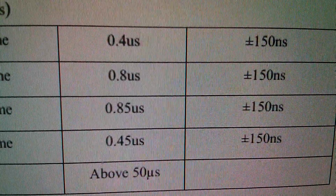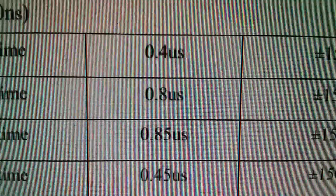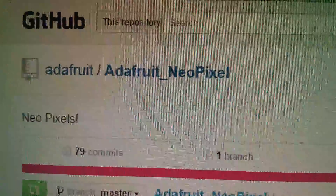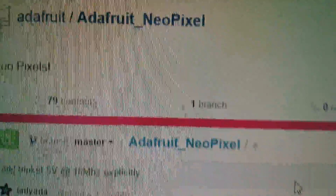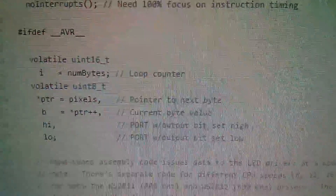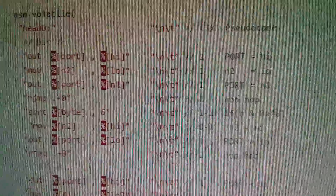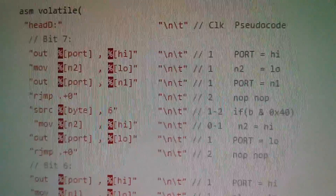Look at the tolerances on these timings — plus or minus 150 nanoseconds. Because of these very short durations for high and low, less than a microsecond, there's a real problem driving this with Arduino because you can't use delay — that's milliseconds. You can't even use delayMicroseconds because it's less than one. Fortunately, Adafruit have a library to drive these NeoPixels. The code includes assembly language — inline assembler — and this bit banging of the digital outputs has to be done in assembler because it has to be done extremely quickly.